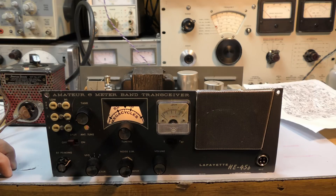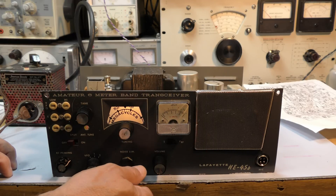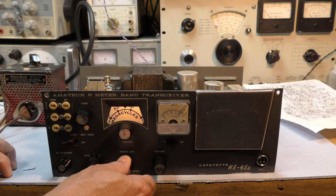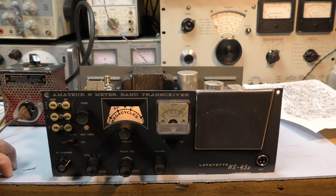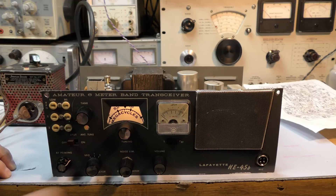With this hum, we know the capacitors probably need to be changed in the filter area of the radio. The next thing we're going to do is come out of limiting. The limiter is out now, counterclockwise — I'm hearing hiss. I hooked it up to my 10-meter loop, a horizontal loop up about 30 feet.